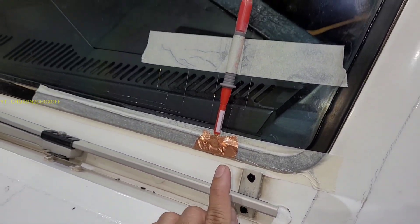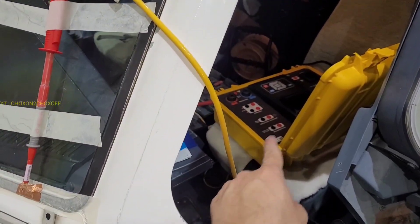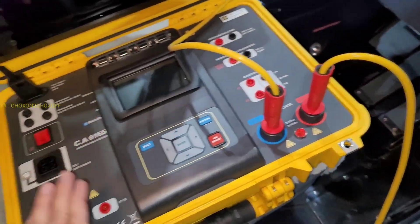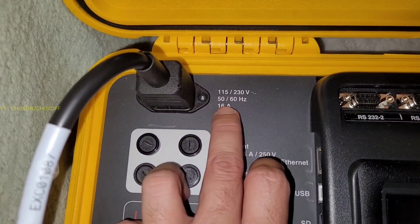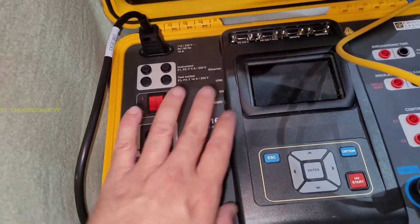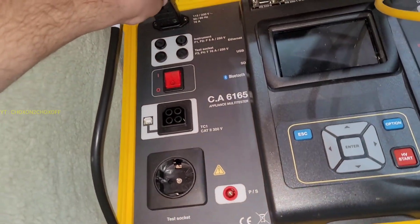During the test, make sure nobody is touching the probes. High voltage is going through the probe. This is going into our dielectric tester — we will connect it. Everything is connected. The dielectric tester has to be connected to the external supply. This is 50 Hz to 60 Hz, 16 amps. We are not taking supply from the aircraft; we are taking it from outside external power. Then we'll switch it on.